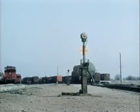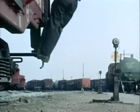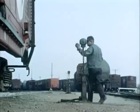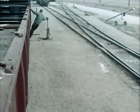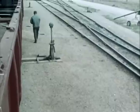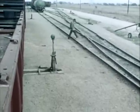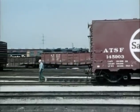Running for a switch can save you 3 seconds. It takes 5 seconds to do it right. 15 seconds to walk back to a switch you passed. 22 seconds to stop and remove debris. 12 seconds to gain 12 extra feet of distance around a string of cars.